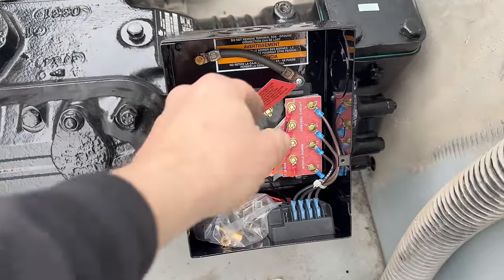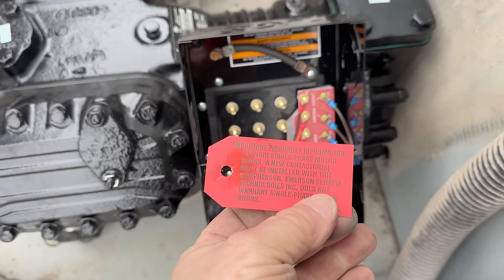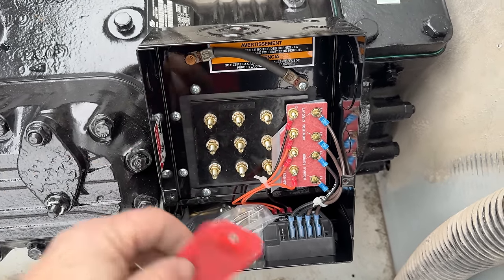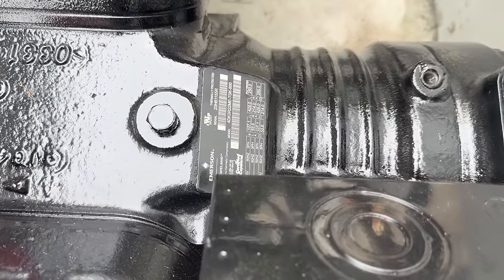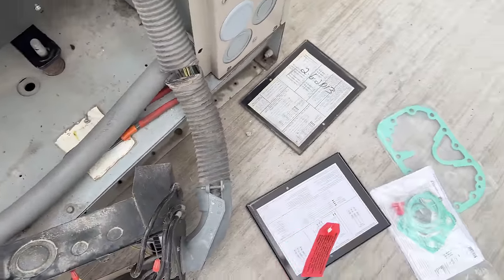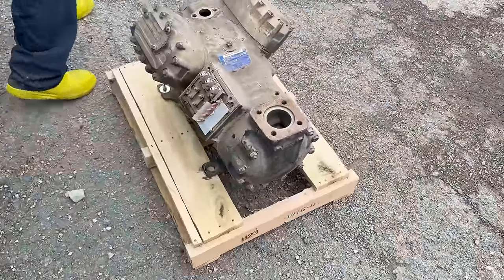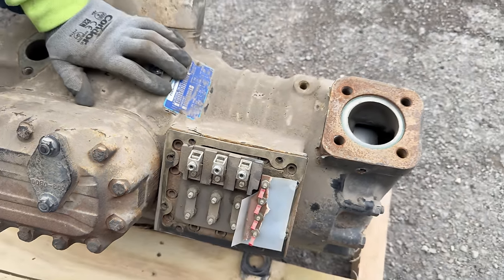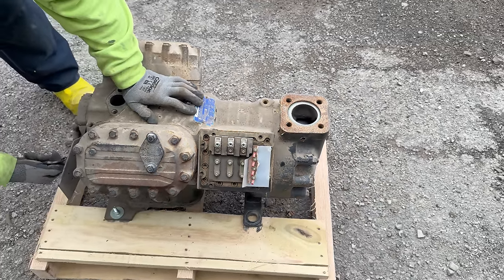That's why we've got all this wiring here we've got to do. We've got to wire it up for 480 volts, so that's going to be adjusted so that you've got the correct wiring. The other one — you can see what they've done here. This is the pattern, so we'll almost likely have the same thing. Then we'll put our bolt lugs there — that's how you know what voltage it's for.